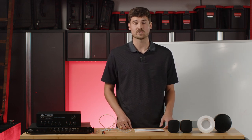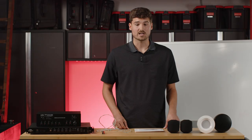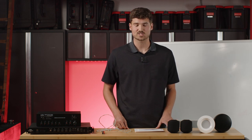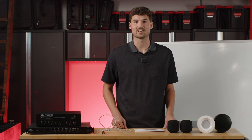The first thing you'll want to do when you get your speakers is adjust the tap settings. The tap settings are essentially the floodgates of that speaker — they control how loud it can get. The lower you tap it, the softer it will be; the higher you tap it, the louder it will be. In a 70-volt system, you'll have different tap settings available, so make sure you adjust those before you get going. The last thing you want is to install your system and then realize you forgot to set your taps.